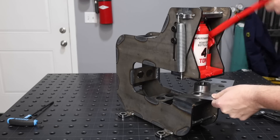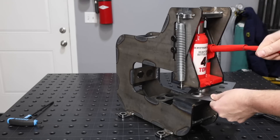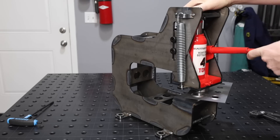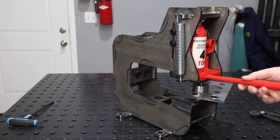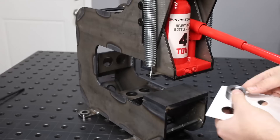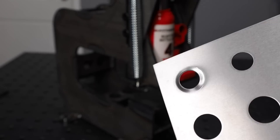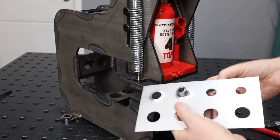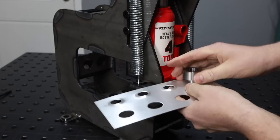Here's the moment of truth. I have a one-inch diameter hole that I'm pressing a dimple die into — this is 16 gauge, or one and a half millimeter thick steel — and so far it seems to be going okay. Everything's pressing down until I feel some load, and then I'll relieve the tension. I think I might put a knob on this like I have on my tubing bender so I don't have to remove the handle. Let's take a look at how it turned out — it looks pretty good, I'm really quite happy with it. I'm going to try this on some 16 gauge aluminum with a three-quarter inch hole. This is a more typical use case for me and it's looking pretty good. Let's repeat a few of these and see if it really is more efficient than how I was operating before — and I'm able to move pretty quickly between them. Even in real time it's a lot faster.